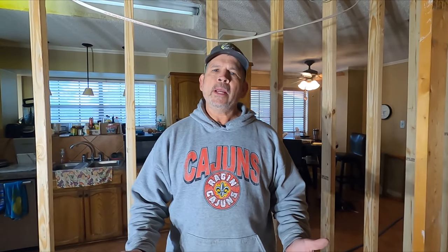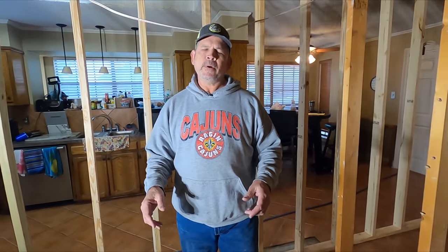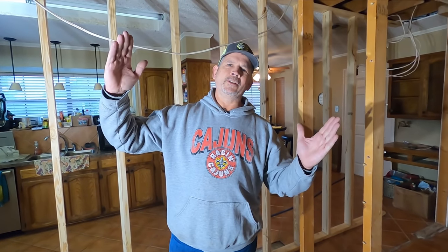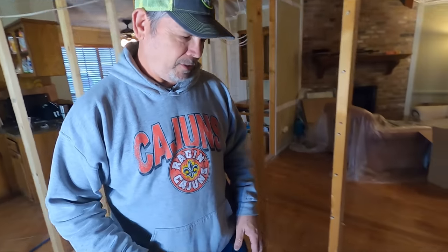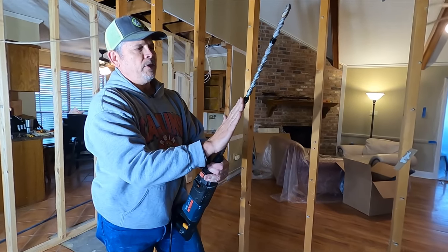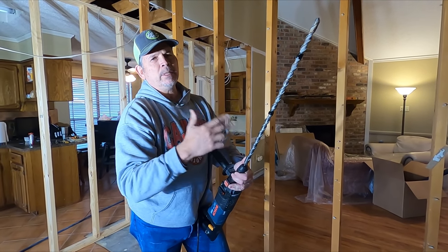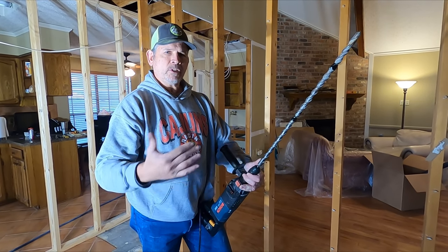So remember when I said that we had the original drawings to this house and that satisfied our engineer? Well, what if you don't have drawings to your house? What are you gonna do? Well, let me show you. In our previous video, I mentioned a 12-inch long bit that I had. I don't know anywhere where that's 12 inches. So I went home and actually got the bit, and here it is. It's 3/4 inch, 24 inches long, and I bought this years ago to determine the depth of a footing on a job I was doing in Southern California, just for the engineer.